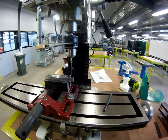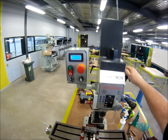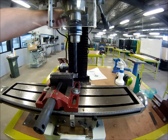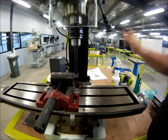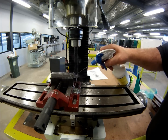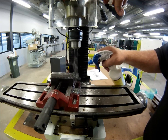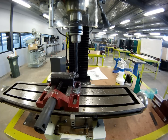Now we've got a 13mm high-speed steel drill bit in the drill chuck, RPM up around 500 — probably a little bit quick, I could turn it down slightly. We'll drop the Z down, lock up the gib on the column, and use the quill handle for the drilling action. That is going through like butter — no problem at all, I can barely feel any pressure on the quill. Very capable little machine. Making chips and smoke — that's what we like!